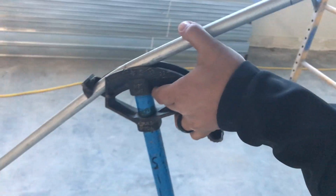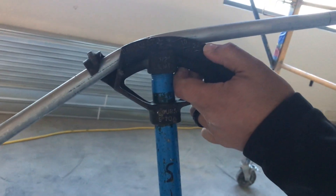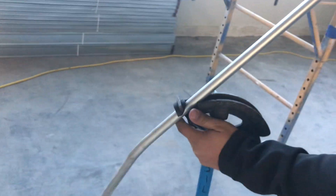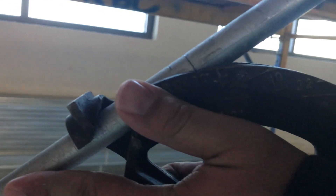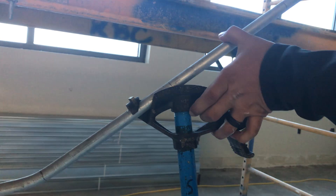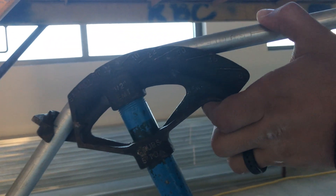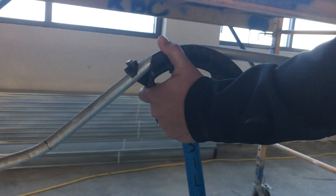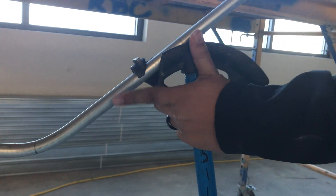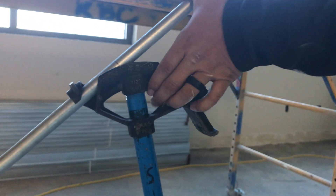Put it on the notch, as you can see right there, and then we're going to do it to 22 — make it parallel with the bottom. Once that looks pretty good, we pick it up, push it down, twist it, put the second one on the notch. Make sure it's centered, and this one's going to be 45. That looks pretty good right there — maybe a little bit more. And we're going to push it through one more time. Put it back on the notch, make sure it's level, and then back to 22.